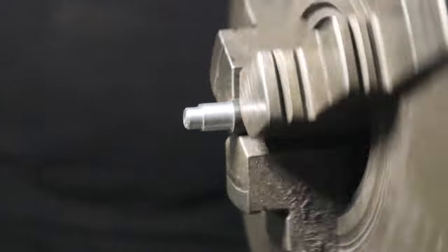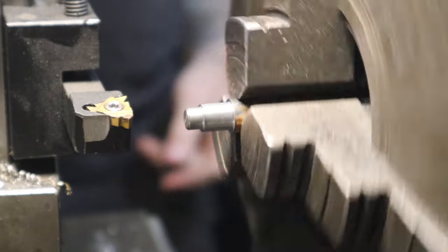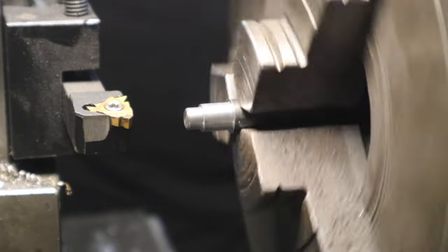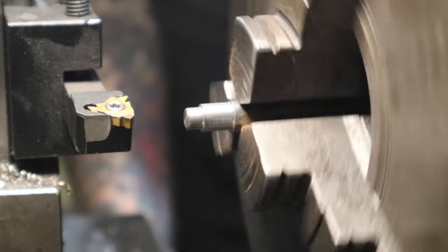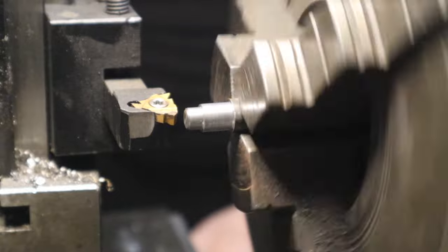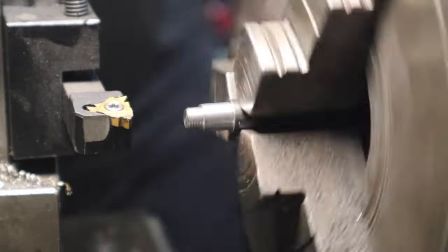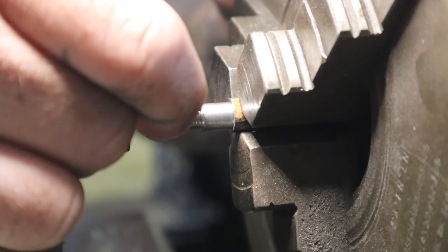I'm just going to do a bit of lead-in on that for the thread. So we're just taking those sharp edges off. Now we're going to set it for threading and we are going to thread that end to 32 TPI. This is running at 130 RPM — I've got a carbide cutter in there, it's a little bit slow for carbide, but I can't be bothered getting my high-speed steel sorted. We'll see how this goes; obviously if we wreck that we can just make it again. This should just be our scratch pass. I like to start my threads a fair way back so I've got time to glance over everything and double-check before it starts. And bang, there we are. Now we can double-check that thread pitch is correct with our thread pitch gauge — yep, we are turning a 32 TPI thread.